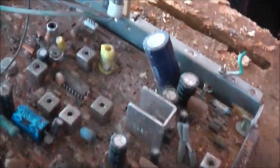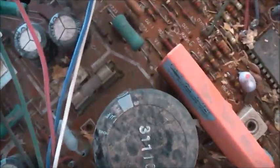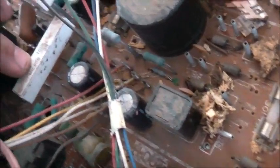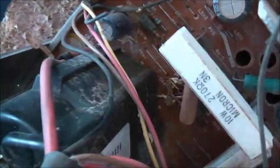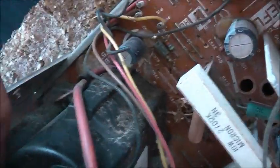This is the actual AV input board. Looks like it's a homemade job back then. Very well made stuff. Nice capacitors. This in here is a 470 microfarad, 180 volts. A 10 kilo ohm, 10 watt resistor, actually it's a 10 ohm actually. This flyback, I think it'd be a genuine Mitsubishi flyback. Very nice sized flyback. 150 ohm resistor. CRT bias. Interesting. And focus.